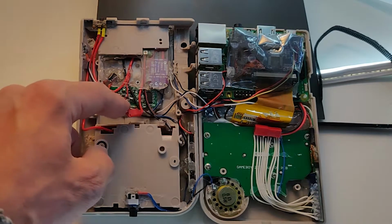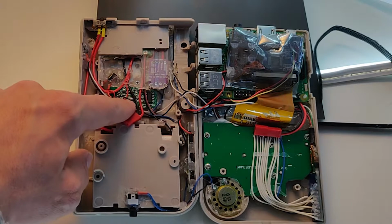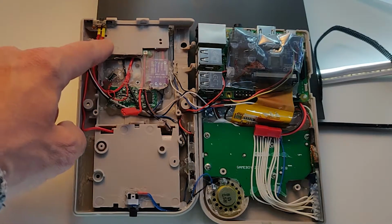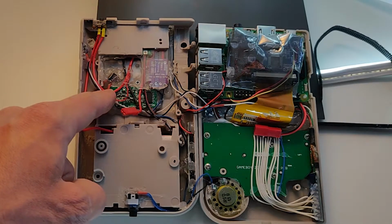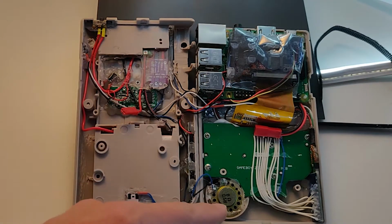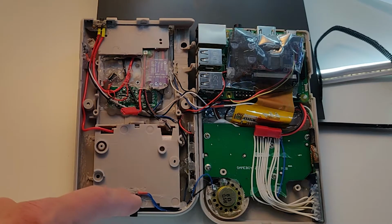And then I've got this small bit of circuitry in here, which is the battery monitor, and that comes off this cable here after the switch from the battery, so I can read the battery levels without the system even being on. So from the amplifier, that powers this 1/2 watt 8 ohm speaker, which can be interrupted by this switch here, which turns it off and on, which is pretty useful.